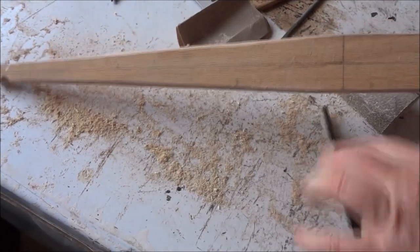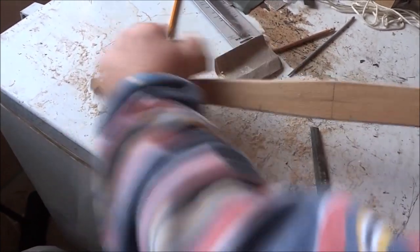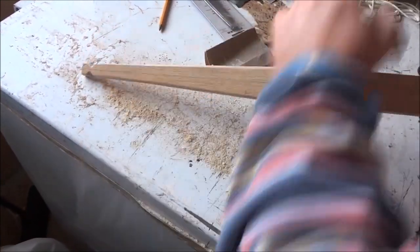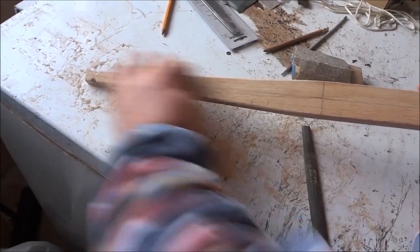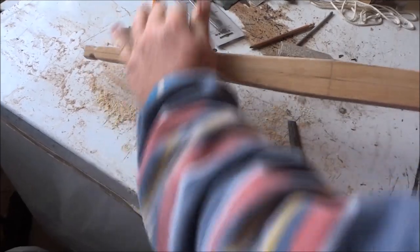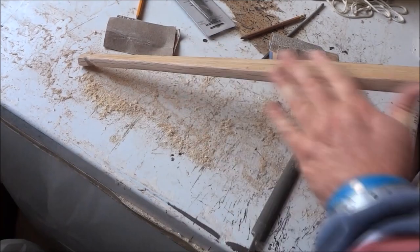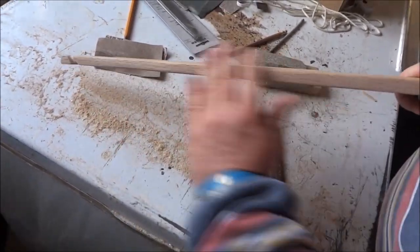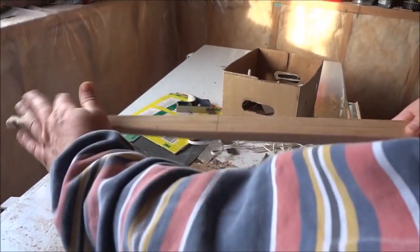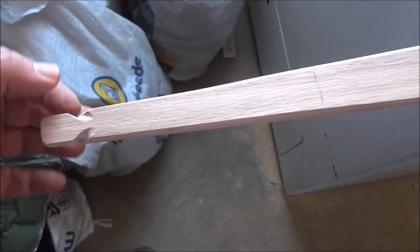There's your half-round of a pea starting to show up — you can see it shine. Then back with the 50-grit, come along and smooth it a little bit. You can rock it with your hand a little bit so it's smooth, then feel it with your hand. You're not going to do this more than once on the nocks — you want to get it right. So just feel with your hand until you know you've got it right, eyeball down it until it's perfect.